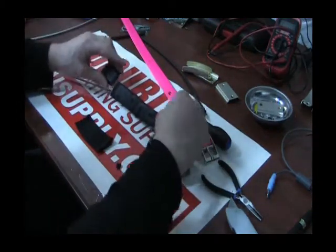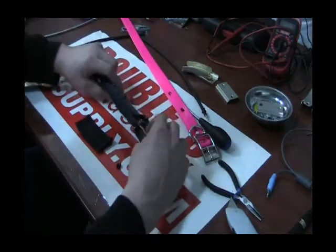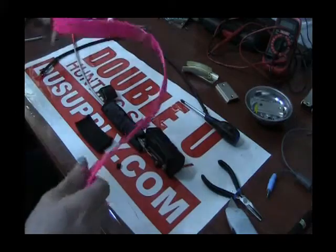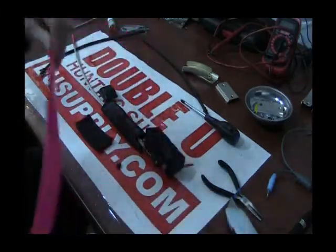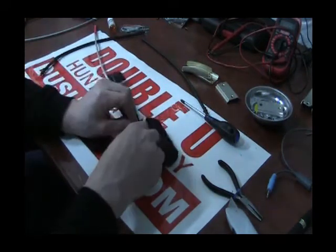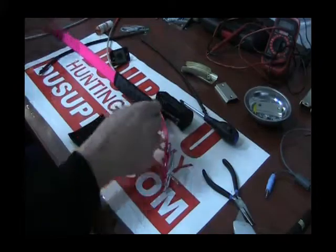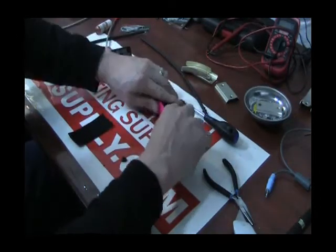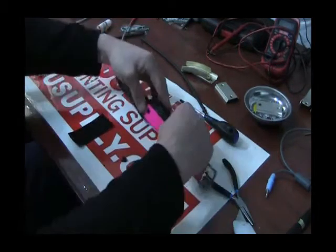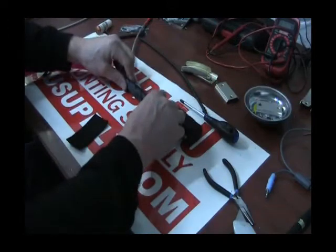Now we have the antenna wire, which is protected by the sleeve, and the GPS wire — leave it disconnected. The hardest part of this is the collar: I normally take some soap and soap down the collar I'm going to use — it seems to slide through the sleeve a little better. If you're having a hard time getting the collar through, use soap. Slide everything through until the two holes line up, and then the GPS connection is next.